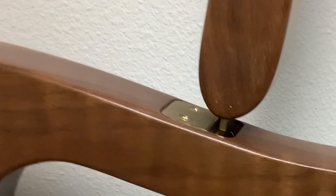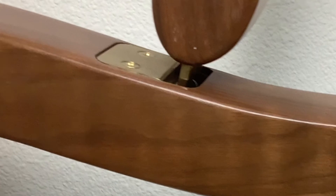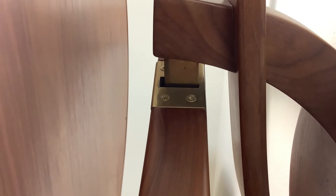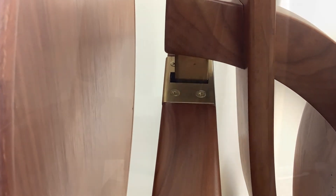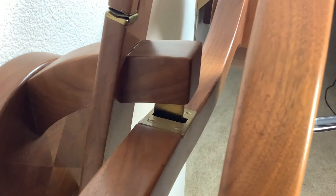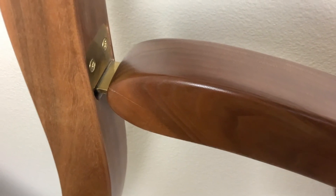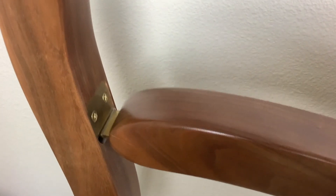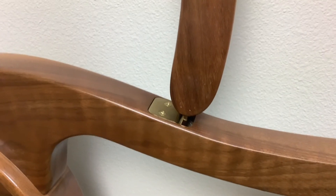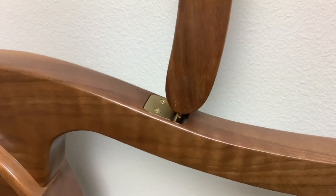The moving parts of the pivot were a one and a quarter inch wide piece of hard steel knife edge on one part that set into a V-shaped groove in brass on the other part. The pivot hardware for the first vertical pendulum was shaped from pieces of one-eighth inch polished brass stock. The vertical part of the pivot was one and a half inches wide and epoxied into a mortise in the end of the wall mount bar. The other part of the pivot was two inches wide and recessed flat into the center of the pendulum bar, held in place by four wood screws. A volume under the slot in this plate was removed to make room for the moving parts. Plates at the ends of the pendulum bars are epoxied into mortises and have the V-groove part of the pivot. When these plates are vertical, a three-eighths inch long piece of plate stock is soldered to the bottom end to make a shelf and the V-groove cut into its top. Recessed plates at the middle of the pendulum bars have steel knife edges attached with high-temperature solder, and are attached to the bars using two wood screws.